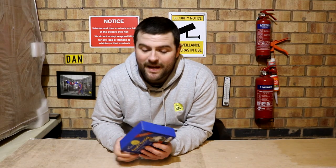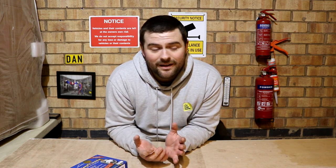They are a little bit expensive at $44.99, but the refill packs are a lot cheaper. Most engineers and plumbers will be able to just get the refill pack — you won't need to buy the full kit because all you're getting extra is the 14mm deep socket, the allen key bit and the crosshead screwdriver bit, which most people will have anyway. Do I think it's worth keeping one on the van? Yes, I do. Most plumbers know that when they go to a job they're guaranteed some difficulty — how many stop taps do you come across that you can't service or turn off because they're all stiff? You could swap them with all that aggro, but it's just a lot easier, especially for a quick job, to slam one of these on. It's saved me a bunch of times and I'm happy to recommend them.